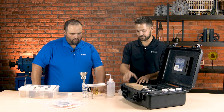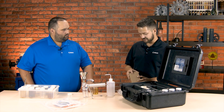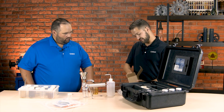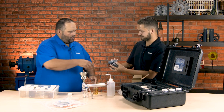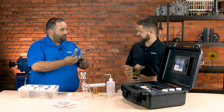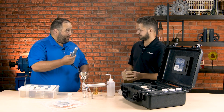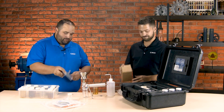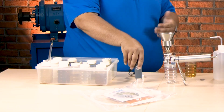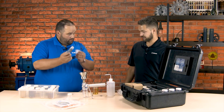After you take a sample and push it through there, follow the procedures — there are several steps. It takes about five to ten minutes to do. Not too bad. You can then analyze it under a microscope. It looks like they sent one of these digital microscopes, similar to yours — it looks almost identical to the one I have. I like this because it's USB and hooks up to your computer, so you can take pictures of what you're seeing. It has its own lights and pretty decent zoom. You can see the size, the shape, and in some cases even the color of the contaminants or debris in the patch.